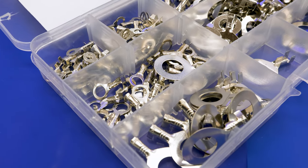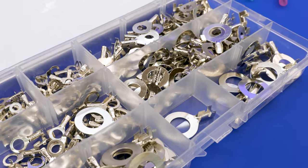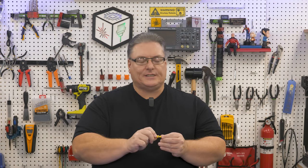I recently started using open barrel connectors when trying to solve a problem attaching a ring terminal to banana jacks. I found that most common sizes are simply not small enough to work on things like a banana jack post. So today I'm going to show you how to use open barrel connectors for smaller gauge wire — really handy for maker electronics — and also cover some ways I've been using heat shrink to save time creating enclosures, so electronics aren't shorting out.